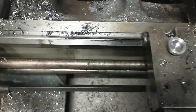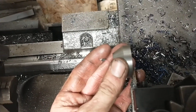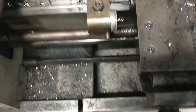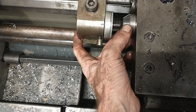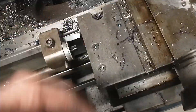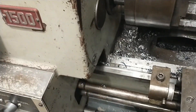The part I wanted to show you is a cheating trick. This thing obviously needs to be the same height as the original. What I wanted to show you — I wish I'd shown it during the machining — is I come up and literally set my parting tool to where it touches the edge of the part. Then, with that sitting there, I take the part I'm trying to copy the length of, stick it in between my micrometer stop and my carriage, and crank the micrometer stop out until it touches it. Then you part it off, pull the part out, crank on over until you touch your micrometer stop, and voila. Doing that, these parts are within half a thou of the same height.